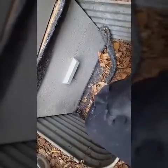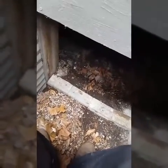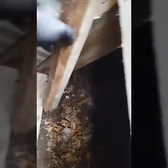I'm going to go ahead and start my demo, and I will start it again once the demo's finished. Okay, this is kind of a worst scenario kind of door. Normally you'll have a foundation running across the bottom, and you'll pull out these sideboards, the old framing board, off of the side of the foundation. And then you'll chisel your foundation so that's nice and flat.